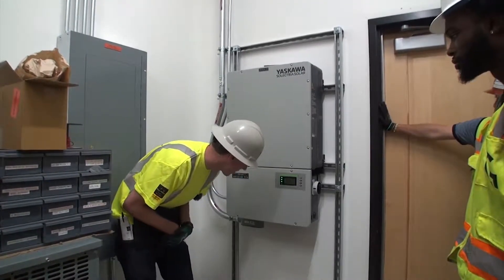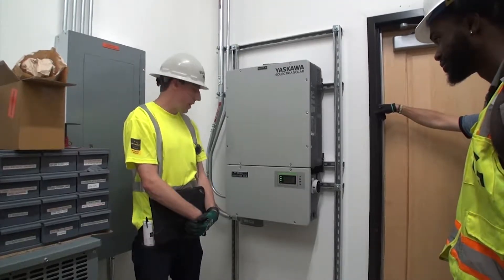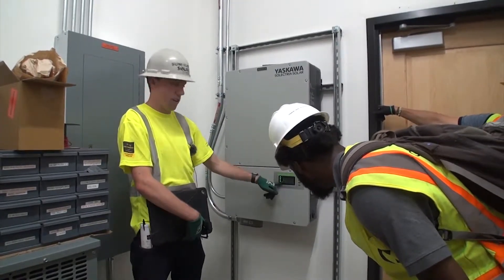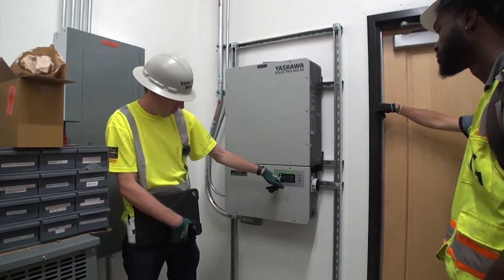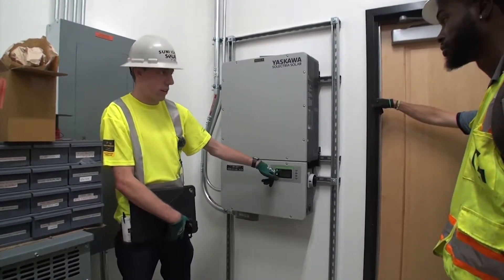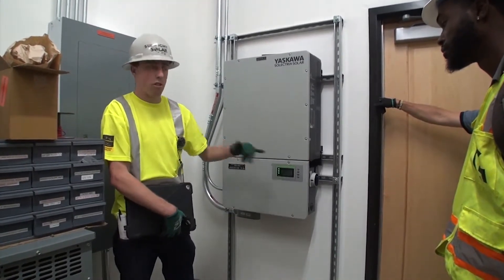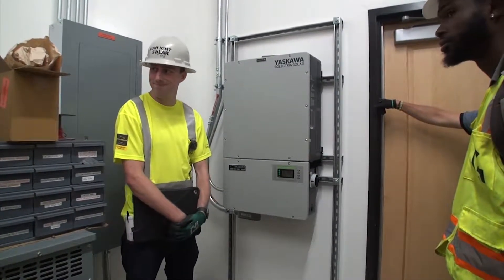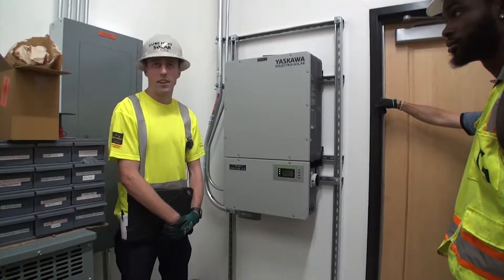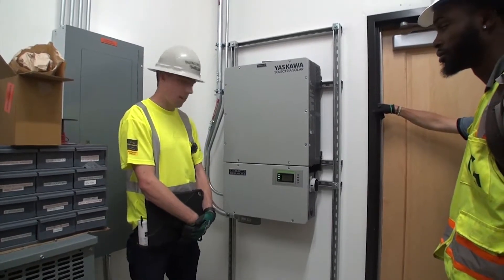So we are now producing. This display is pretty straightforward — it rotates between two different inputs. There are five strings in total on the bike canopy. One input has two strings, one has three strings, so their power output is not identical. But you do have your cumulative power on the right side. With the online monitoring, you'll be able to guarantee you're getting bang for your buck. Is it two MPPTs then? I believe so. Do you have anything with the stringing on it — like a string map? Yes, we have that in our plan set and we can definitely redline that out for you.